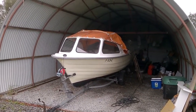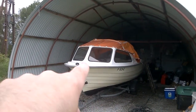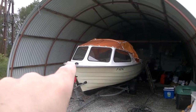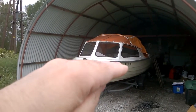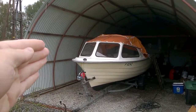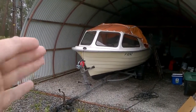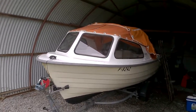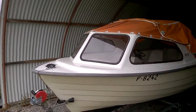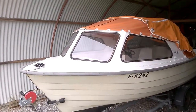She's had a lot of work done to her. She used to be orange — the same colour as the canopy here. All this top part was all orange. What I've basically done is stripped the whole top half of the boat off, and all this fibreglass panelling here, even this top section — I took it all off about two months ago and sanded the whole lot of it down. And over time I've been repainting it, doing it up, filling all the holes in. And I think it looks much, much better now than it did before.